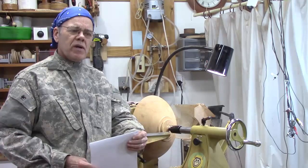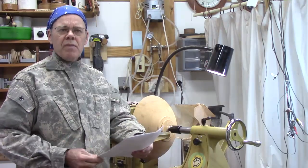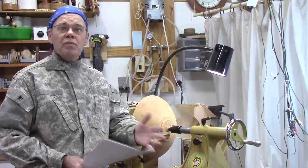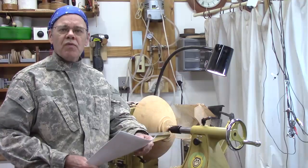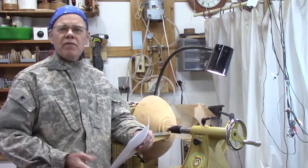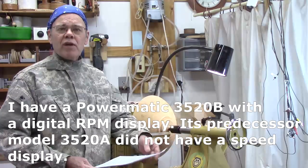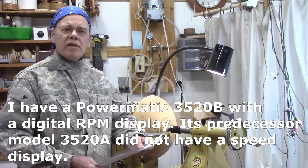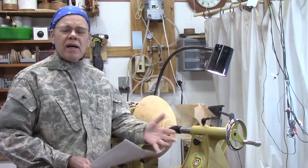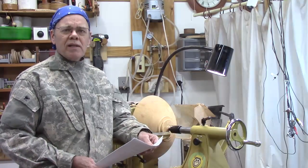In many instances there are experienced turners with a belt-driven lathe who adjust it by pulley, and through experience they've learned which pulley adjustment to use for a particular task. For some individuals with a variable speed lathe such as the 3520A that doesn't have a direct readout, turners have learned to tell by sound, feel, and vibration what is the comfortable speed for that particular task.